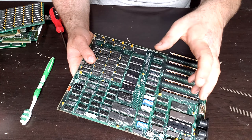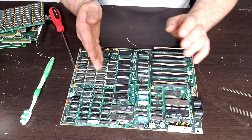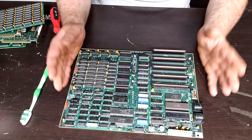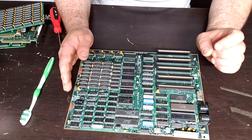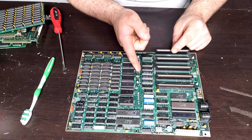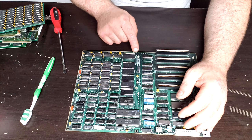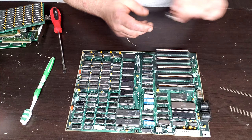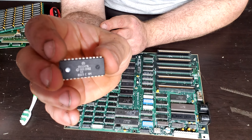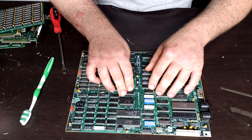I need to find the other 5150 board to take the sockets off that dead board for this one, or just check eBay. I did some research on MinusZeroDegrees.net, and from the date code and what I found there, I believe this is a Revision 3 board — and specifically, I think it's a very late 5150. The real kicker for it being Revision 3 was the BIOS chip from U33 with part number 1501476, which confirms Revision 3. It's got a date code of the 23rd week of '83.